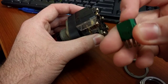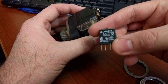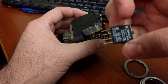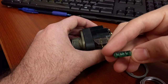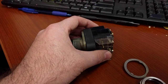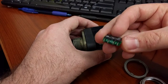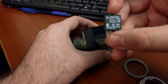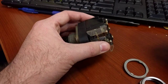Here's a switch — this one's actually bad. But if you look carefully, you can just solder on these terminal poles right here, depending on which one's the normally open and which one's the normally closed. 3 and 4, you can see it's right there — normally open, 3 and 4. So this might be a double-pole. I would need to consult the tech documents. This is another example of a terminal block where you would probably have to solder the wire connections on for a switch.